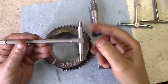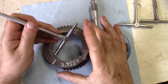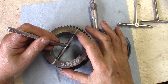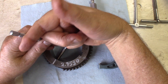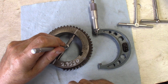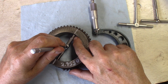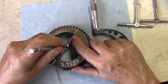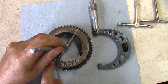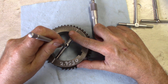The gauge probably has in memory the last measurement you made. So you use the top screw there to release the telescopic pins. Make sure they operate freely in and out. Introduce the tool into the bore. Usually I try to center the body on the pins - just probably personal preference. Rocking the handle in that direction so this pin is high and this pin is low in the bore. I'm going to make it perpendicular with the axis of the bore for coming out after. Tying up the screw on the top - not so little that the pins will come out by themselves pushed by the spring, and not so much that it becomes almost impossible to pull it out of the bore.